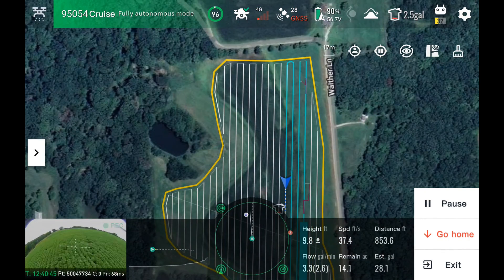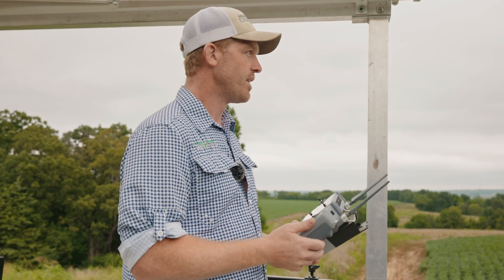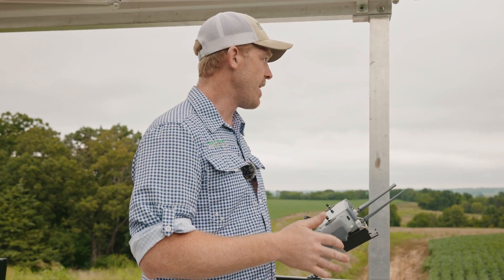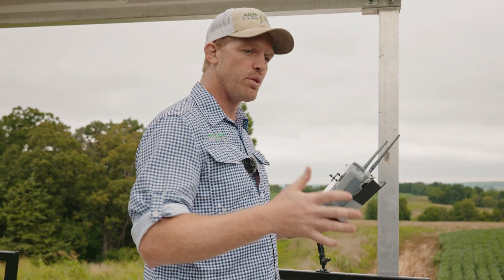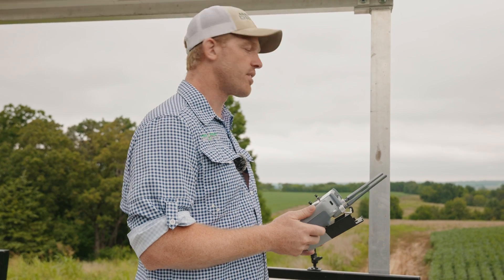And there, now it's cranking back up to 45. All of this is editable before and during the operation, and when it's on the ground as well. Remember this feature, especially if you can only spray one way and you're at the end of the wind in one direction against another direction. That might actually help reduce burning of the crop and help increase consistency of coverage.